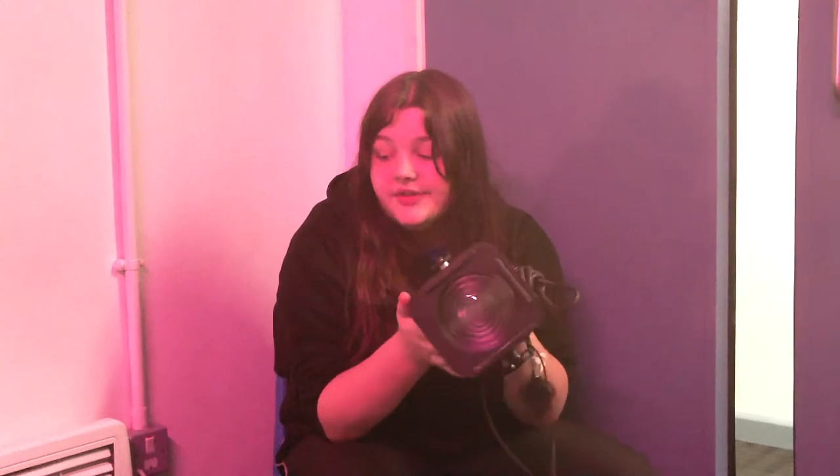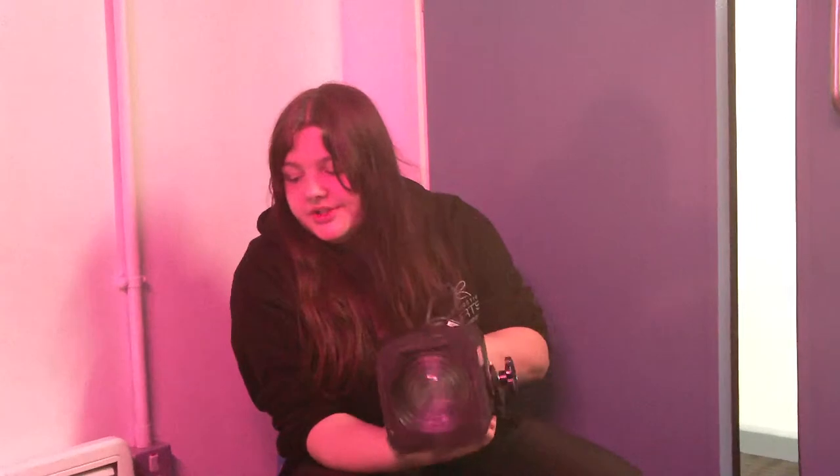We're talking about the Fresnels. We'll start with this one, which is the CCT Minuet, identified by its circular ridge lens. This has a 650 watt light, and it's a soft edge, so it's easy for blending for general washers.